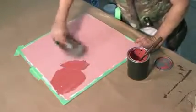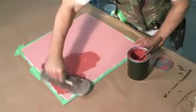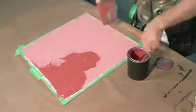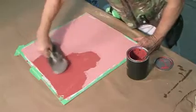When the first coat has fully dried, you may begin the final coat of Marmorino. Apply the final coat with medium pressure on the trowel. You will notice that the second coat bites into the first coat, leaving a fairly smooth overall finish.